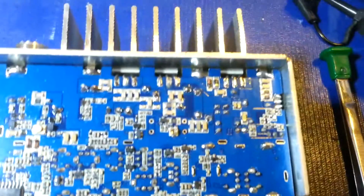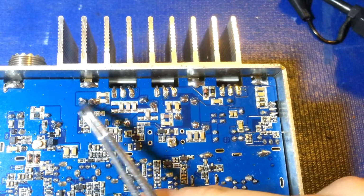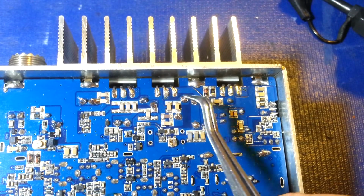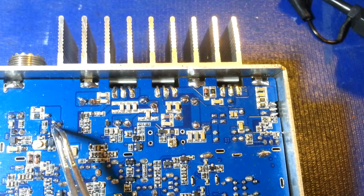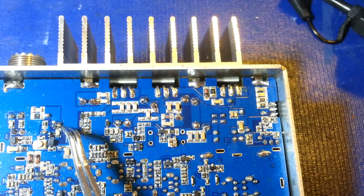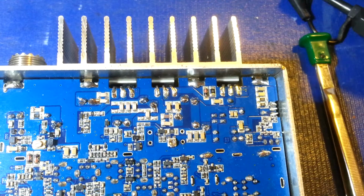So there we can see, if you look at those solder joints, you can see how nice and shiny they are. And no signs of bubbles, no uneven texture, all of them. You can even see when I bring the tweezer in there, see that reflection on the left side of that solder joint. That's what you want to see, little mirrors.